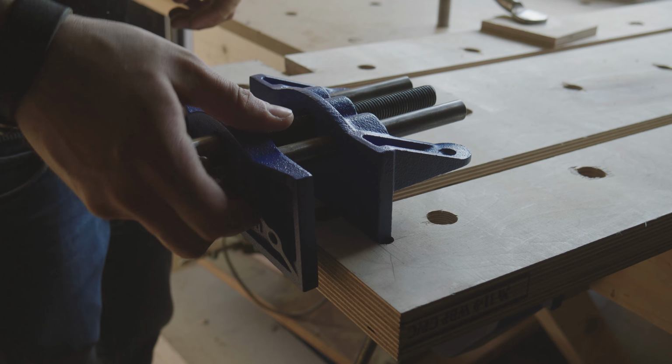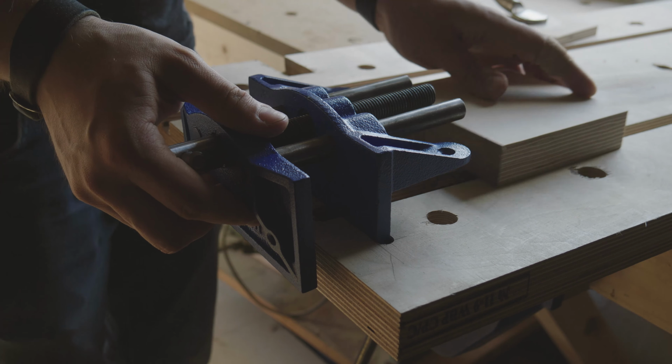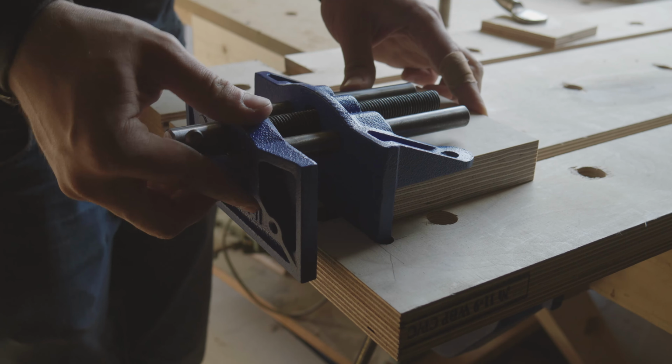The vise needs a small recess so that it can reach a little bit into the panel and doesn't get too bulky. I do this again with the router and the parallel pins. The procedure is the same as with the grooves for the C-rails. Here you can now see that I didn't have to take so much trouble with the C-rail groove because the rail can't reach in it anyway. The vise blocks it beforehand. A small piece of multiplex for support fits perfectly to attach the vise.